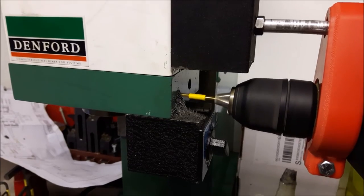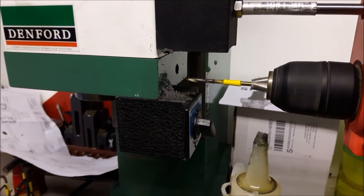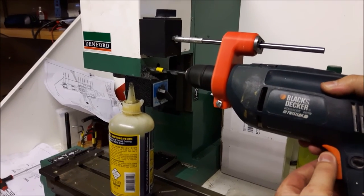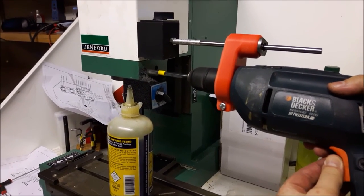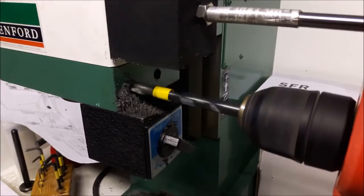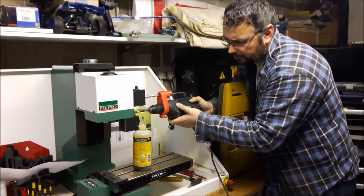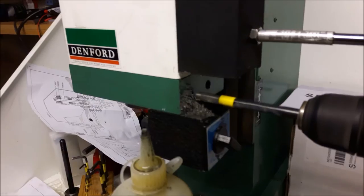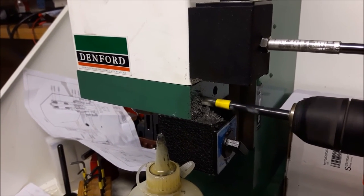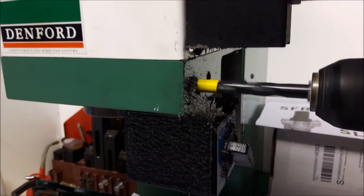There was a minor issue with the aluminium joiner between the rod and the guide stopping the bearing going all the way in. Moving on to the bigger drill bit — just adjust the speed down and you have to adjust based on the pressure to get the right cutting speed. That seems to have gone quite well — lots more filings, but really chuffed with how that went and got a nice clean hole.